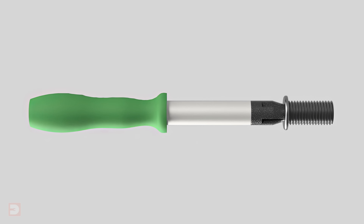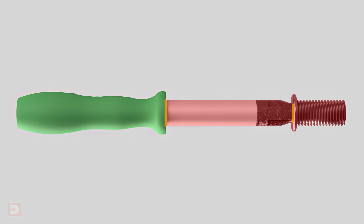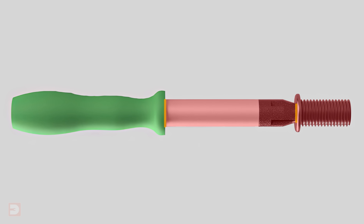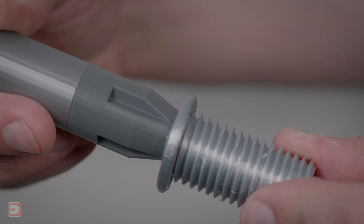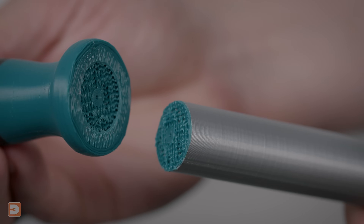This was at the point of a layer change between a silk PLA and a regular PLA, which could suggest an issue with these two filaments bonding. However, it did require a lot more lateral force to break than the cane is likely to experience in general use, so I wasn't too concerned. The real issue was when strength-testing the bottom section — the screwdriver. The long extrusion of the screwdriver was already thinner than any other part of the cane, and the point at which the screwdriver met the large screw at the foot was almost as thin as the diameter of the snapping screws. This part snapped both at the point the screwdriver connected to the big screw at the base, and also at the top of the long extrusion connecting to the handle. So it was back to the drawing board.